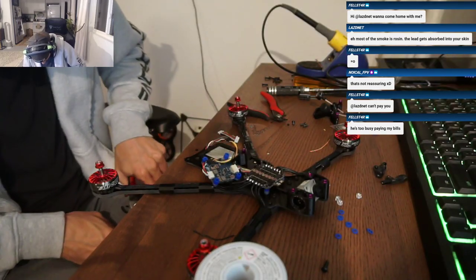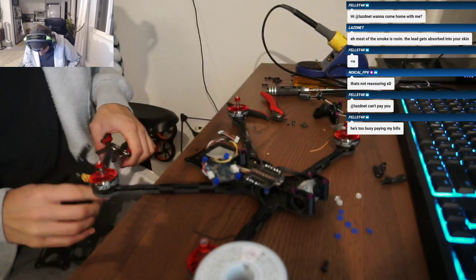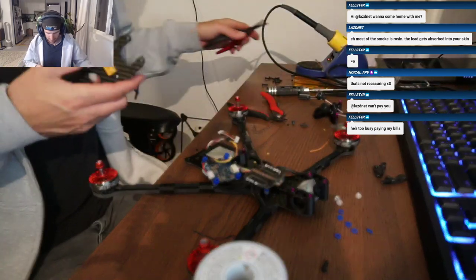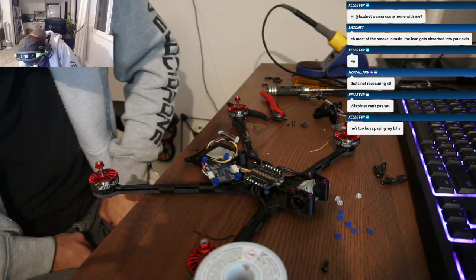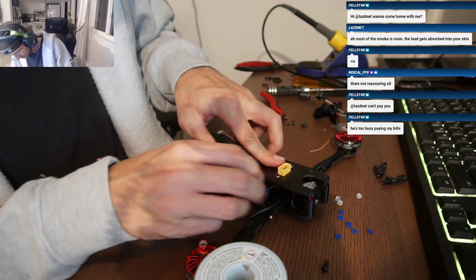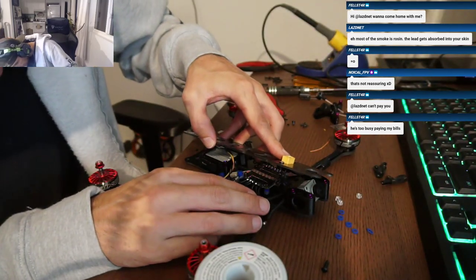The key to making your wires not get stiff like that is ultra high heat, flux on the area of contact, and as quick as you can. All I have is a TS-100 soldering iron. There's no such thing as high heat. You got to get yourself a Weller workstation, man. This thing will do 850 degrees and keep it there. You get a big old fat tip so you've got something to hold that heat in. That's what I've been soldering with for 23 years. I don't have that. It's a $100 investment. I spent all my money on cameras.